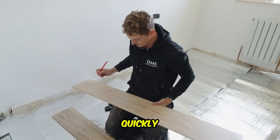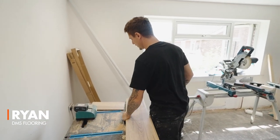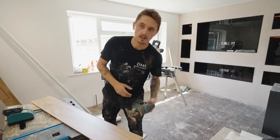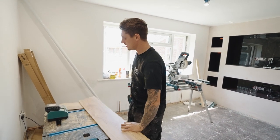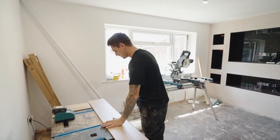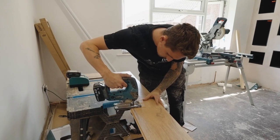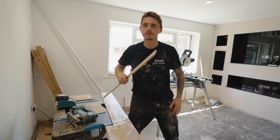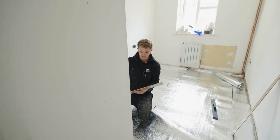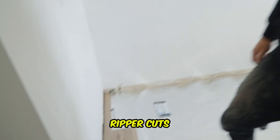Would you cut this for me quickly? Have you got any tips for cutting laminate? If you need to do a neat edge, you have to come from underneath. Obviously they do chip, but there's no skirtings on, so it's going to cover the chips anyway — that's absolutely fine. There we have the ripper cut. Have a look at the cut. That's how you do your ripper cuts.